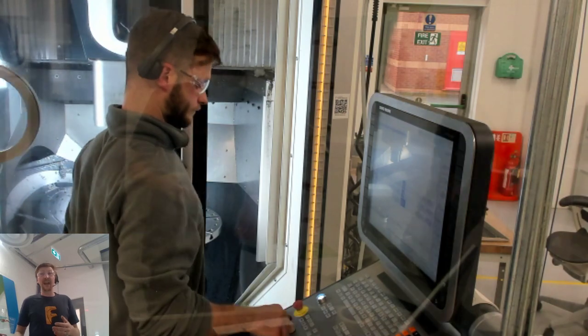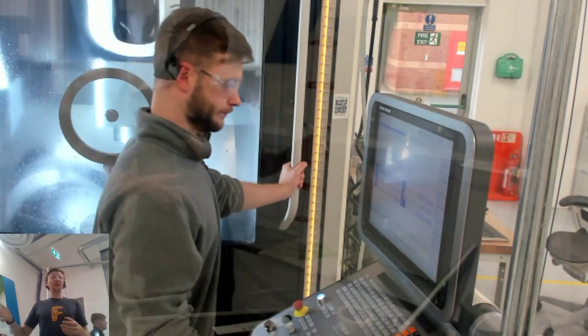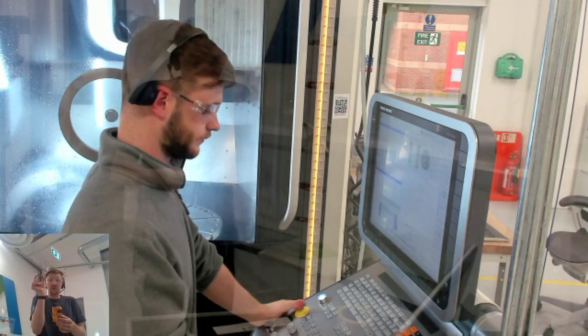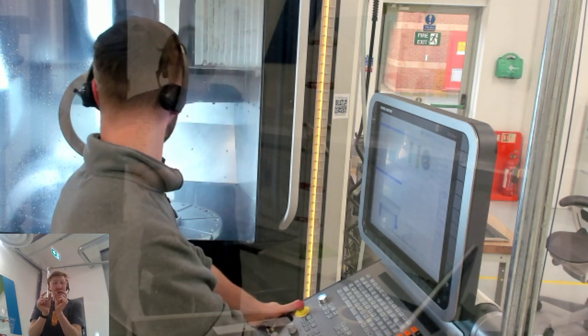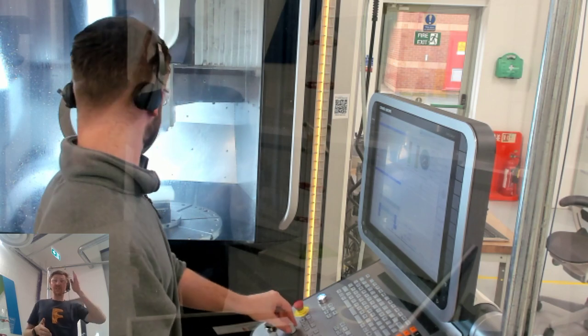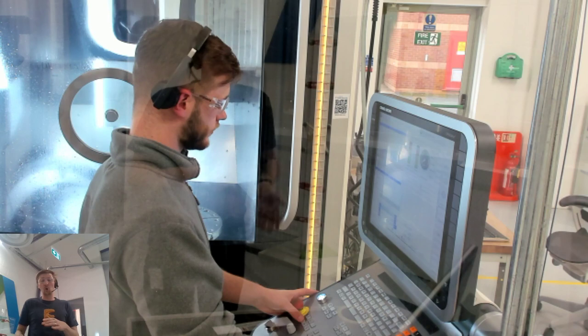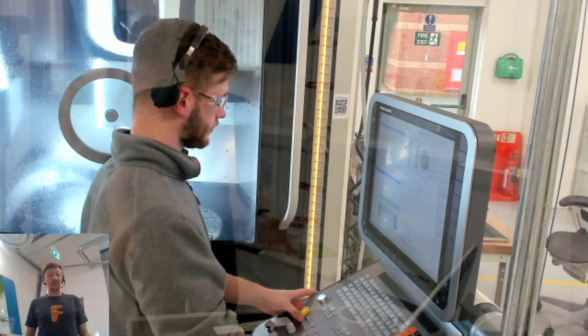If you've got a slip block in there as well, let's say you've got a 10 mil slip block, you'd have to subtract 18 mil off. So you have to do the slip block and the radius of the tool, because you've got to think the machine thinks in spindle center line. It doesn't think about tool edge. That's the whole reason why we have cutter compensation.